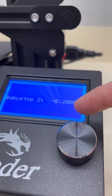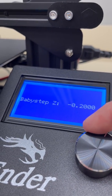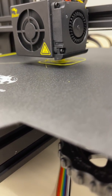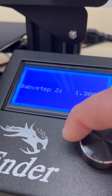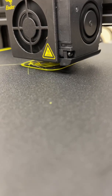That's showing us that this is going to be a successful calibration. Notice that it went down by 0.2. I can do the exact same thing and turn it up — say it's too close to the bed and pressing a big mark — I can move it up by little steps. You're going to see that nozzle head go up and it won't stick. Going to the right brings the nozzle up, going to the left brings the nozzle down. For me, the initial correction was negative 0.2, and that takes it exactly where we want it.